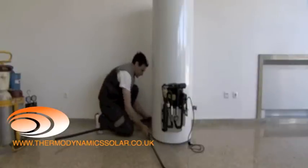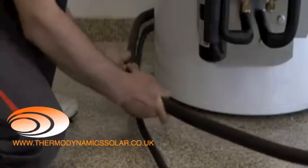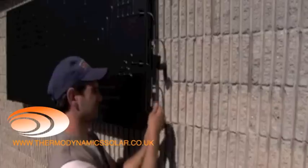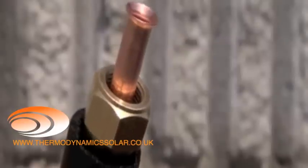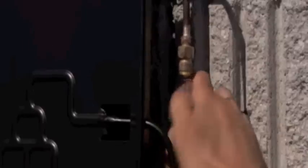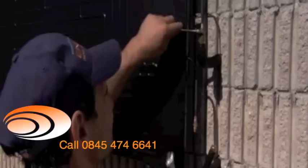Unwind the copper pipe from where the solar panel is placed to where the thermodynamic block is located. Before performing any procedure, insulate all pipes. Remove the nuts of the connections and place them on the side of the pipe, and do not forget to remove the copper lids. Then make a flare on the pipe with an appropriate tool. The flare should not have edgings nor imperfections, ensuring that the walls are uniform. First tighten up the nut by hand, then complete the fastening with a wrench.